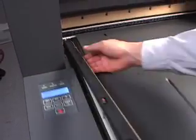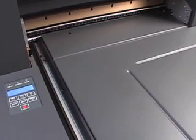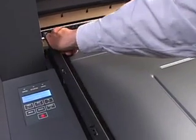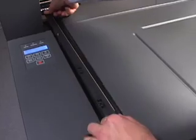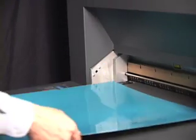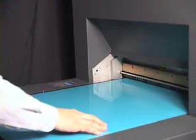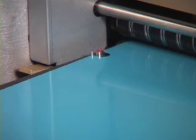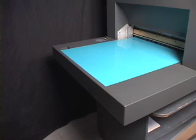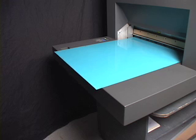Some presses require a notched plate. ECRM provides matched registration bars for this application. MAKO CTP was designed to allow for a quick swapping of the registration bar to allow for notched registration. Using the notched registration bar, once contact has been made with the saddle of the notches, the segmented pinch rollers engage with the plate, ensuring accurate registration from plate to plate.